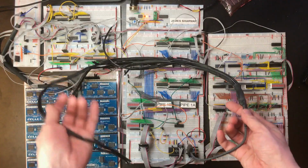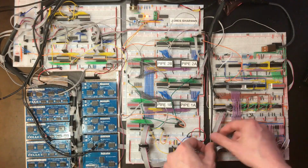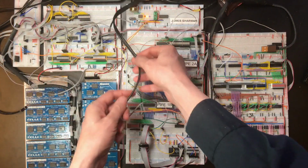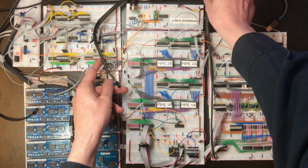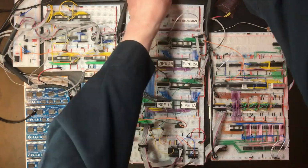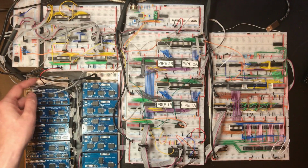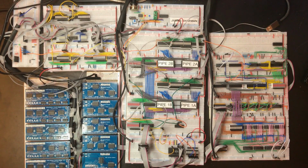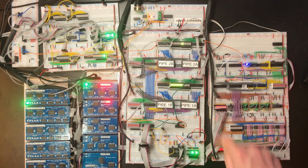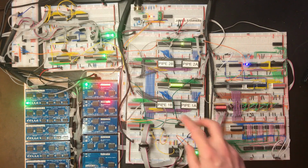Okay, so I have soldered this up. Hopefully this is going to help us out. If nothing else, this is going to eliminate power issues from the investigation, but all the time we've got the kind of power issues that we're seeing, I won't be able to get it out of my head. The wiring points down here aren't ones I can easily plug one of these DuPont cables into. I was annoyed that the sleeve on this stuff is so thick, but I'd rather put up with that than have a build that doesn't work.